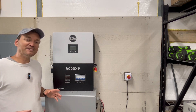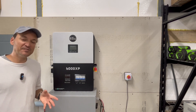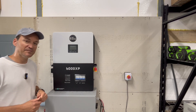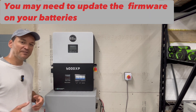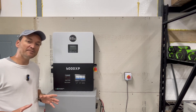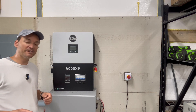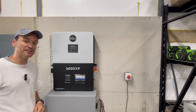This video is specifically centered around shutting down the inverter and the battery. If you wanted to shut down your arrays as well, there are options like solar optimizers on each individual panel, and those hook into a port here with a 12-volt power supply. The EG4 battery versions compatible with rapid shutdown are the LL model version 2 and above, and the PowerPro model — both indoor and outdoor versions. You can also wire it into the battery communication port if you don't have a Lux Power inverter and still want rapid shutdown capability.